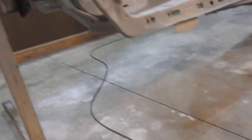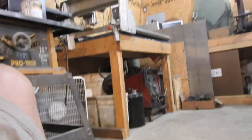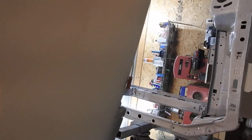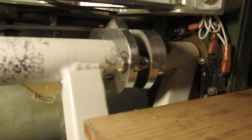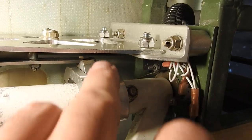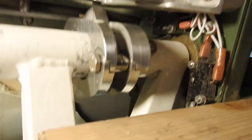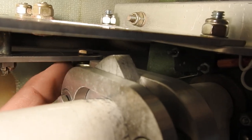Let me get under here and show you what I did. I did spend the last hour in here cleaning before I decided to do this video — using that CNC really throws fine chips all over and you track them through the whole shop into the house. Now you can see the ½-inch thick piece with the ⅜-inch thick pieces, and there's the cam in the center. The cam is not pinned yet — it still needs to be drilled and set-screwed or roll-pinned. You can just make out the shininess of that 3/16-inch rod end.